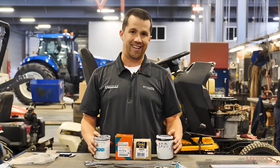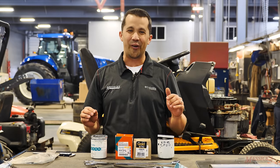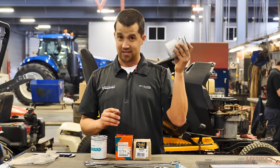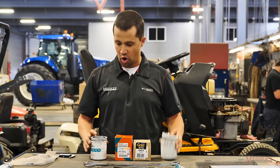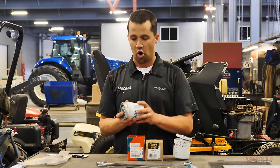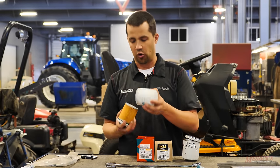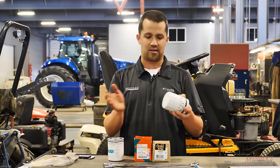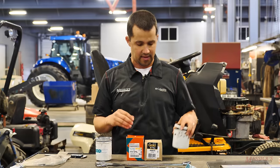First and foremost, the difficulty in cutting open the cans on the Napa filters is very, very different than the OEM. Just like I found with the engine oil filters, I could go two or three passes around the hydraulic filter with the oil filter cutter and pop it right open, whereas I spun around and around on the Kubota OEM filters to get them open. The cans on the OEM are much, much heavier than what aftermarket oil filter cans may be. That gives you crush resistance when you build up pressures inside these cans or they take impact from the outside — there's just a lot more metal there to protect the guts of that filter.